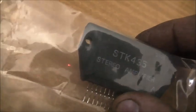The STK IC arrived quite quick. Getting a good turnaround with the UPS, and with this, really good. Although it came in a Sanyo branded packaging. I'm 90% sure it is this, and that's the problem. Little surface tiny components in there would have gone bad in that amplifier. So replacing that will more than likely fix the issue with this thing.